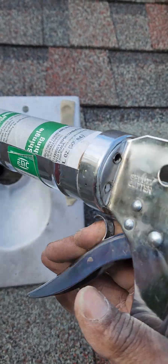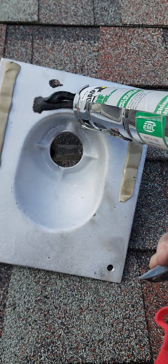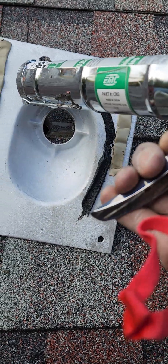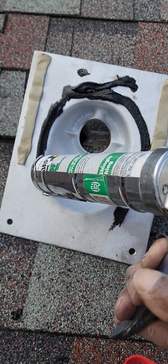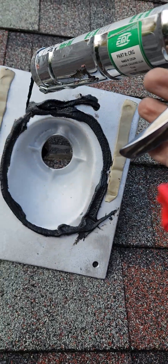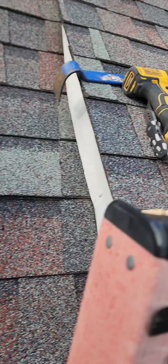We've got different ones but that is the one I normally use. The other two holes should not be a factor, but when you're sealing up roofs, why not just go ahead and play it on the safe side. This stuff is really thick — it's supposed to stay pliable to keep that water out. I'm just going to go ahead and hit that again up top and hit this weak spot right there. It's actually underneath the shingle — that one won't really matter that much.